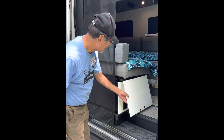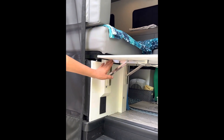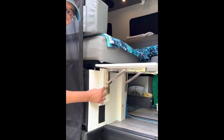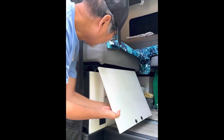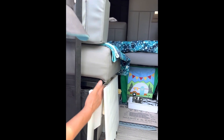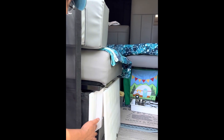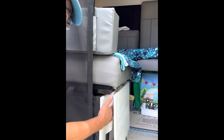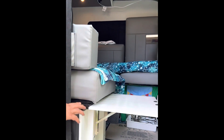I bought these stainless steel metal brackets — this one is 12 inches, that's the normal length. And I added this 2x4. The reason for that is you need the edge of the bed to be the same height as the filler, so when you install the brackets it's aligned with the edge, and you can align it with the bed frame. The material here is birch plywood.